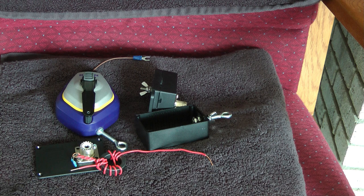Or if you say, well, I don't like a 2-to-1 SWR right now on 20 meters, I'm flat on 40, you can roll up just a little bit of wire, maybe take your SWR up to 1.5 to 1 on 40, and then you'll see it drop below 1.5 to 1 on 20. Neat little antenna to play around with.